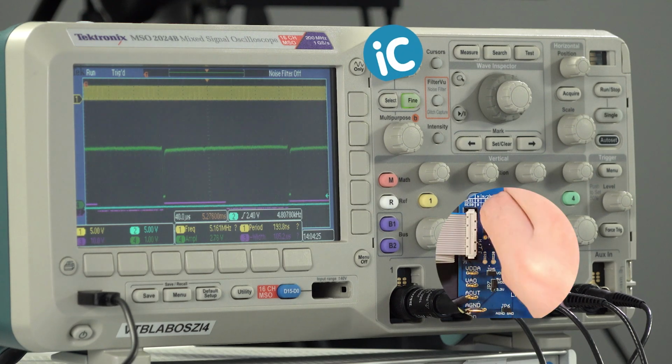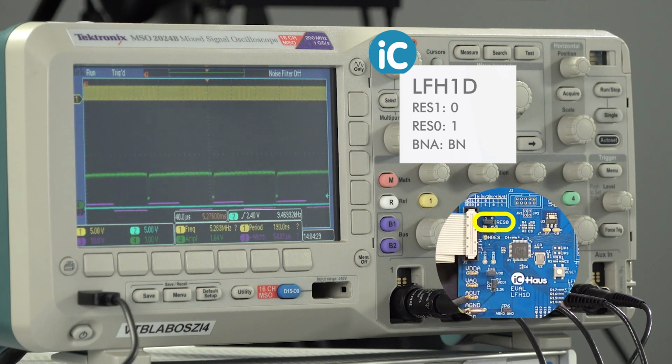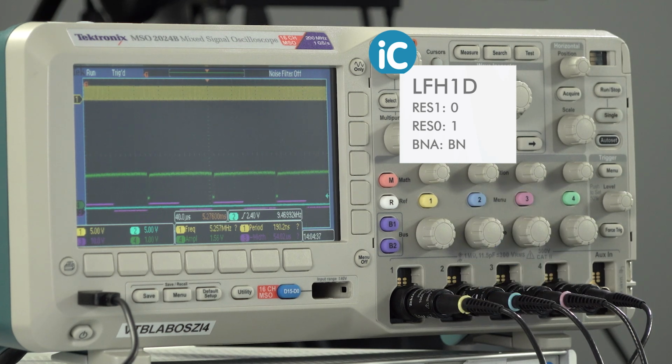Last to present today is the binning feature to increase the sensitivity. I'll have to use it in conjunction with the lower resolution feature. So first, I change the jumpers to a lower resolution. Jumper RES0 goes to its 1 position. Now, always 2 neighboring pixels are used together. The frame length got shorter, only 512 pixels now.